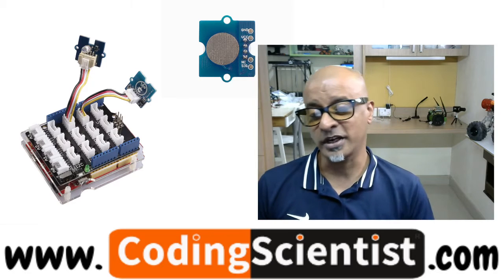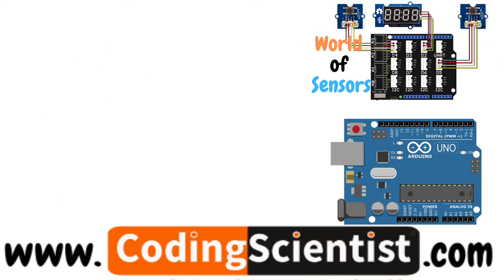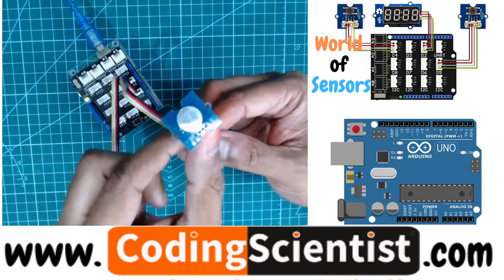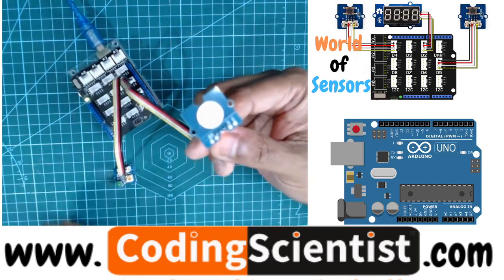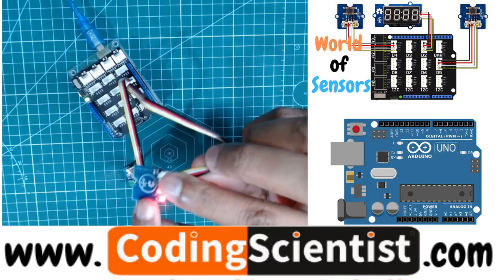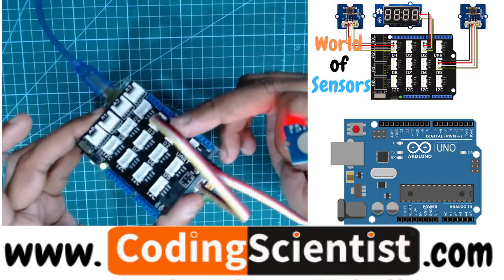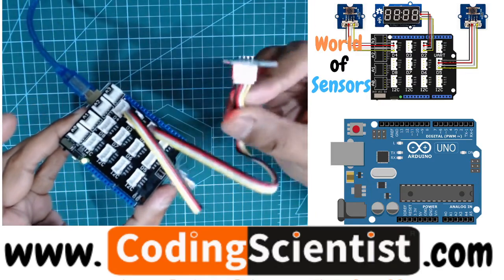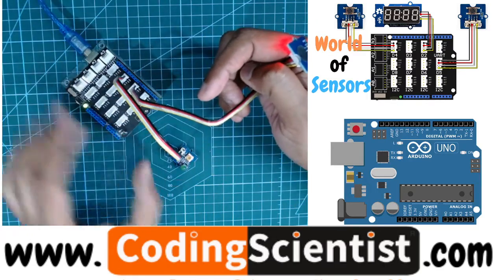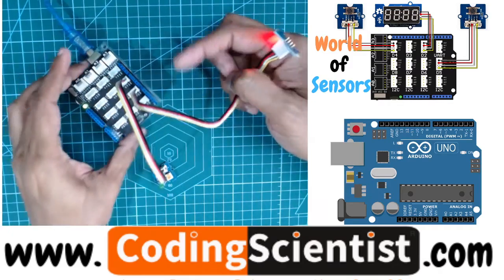Pick up the sensor and connect it to the D2 port, and also connect one LED to port D3. At the bottom of the sensor there's a touch plate — a kind of silver foil — and there's an onboard LED as well which glows as soon as you connect it. Hook the touch sensor to the D2 port and connect one LED to D3. I have connected a green LED just to test it.